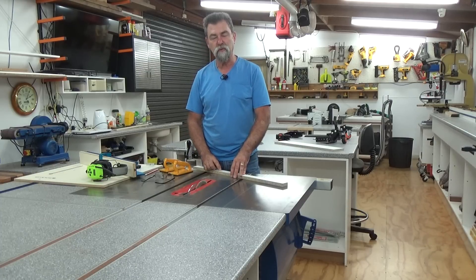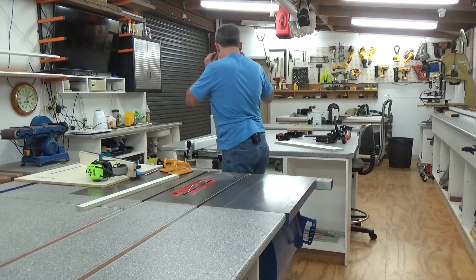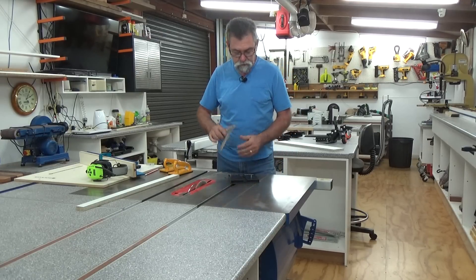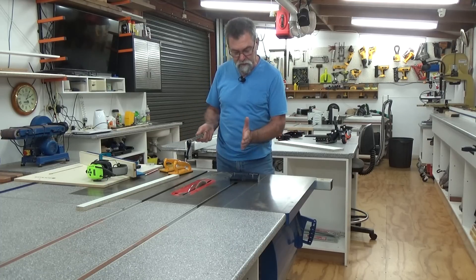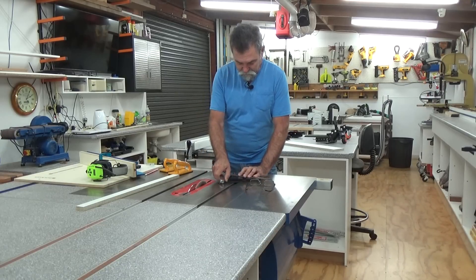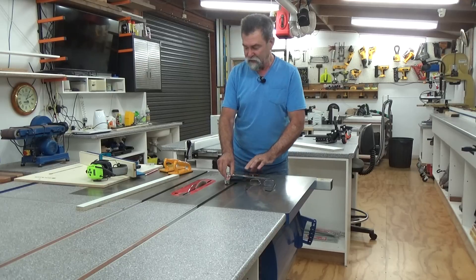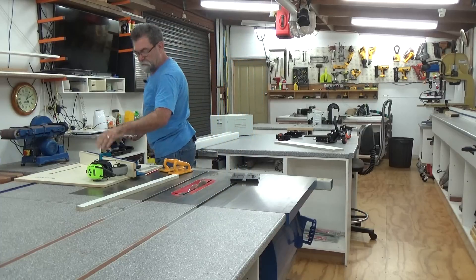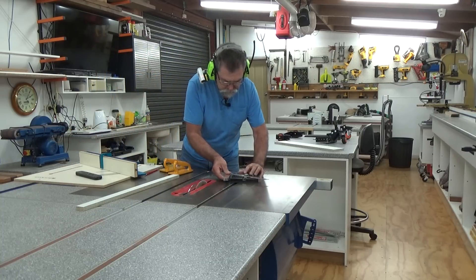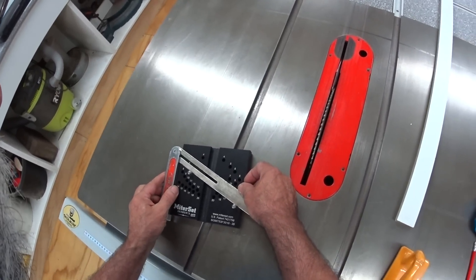Now I'm going to do it with a cross-cut sled and show you something else as well. Here's a little thing with the miter set segments — this is the one I was talking about a few months back. I've realized that if you want to, you can set angles from this straightaway without even putting a miter gauge in. You set up your angle, then get a sliding bevel and bring it down the side, line it up with the pins. How magic is that? I can transfer that straightaway to anything I want. I'm going to transfer it to the cross-cut sled — looking pretty good. Check it back again — beautiful. Double check, come back the other way — absolutely glorious.